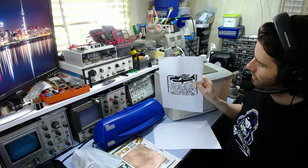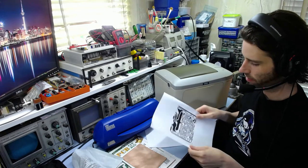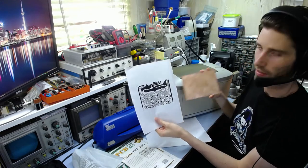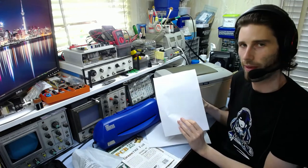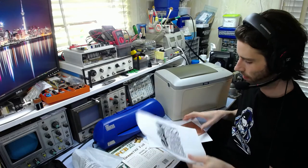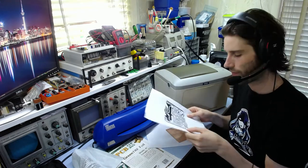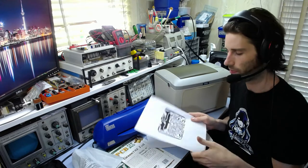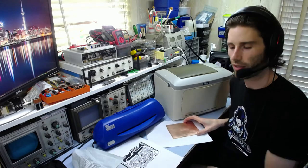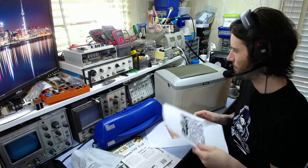Here's the artwork. An important point: this is printed backwards. It's the correct way up as you'd view it from the copper side of the board, but when you stick it onto the board face-down for etch resist, you have to flip it, which means it will be backwards. So you need to print the image mirrored so that when you flip it over it becomes the right way around. The most obvious indicator is the text — it should read correctly when the paper is face-down on the board. Do a test print on normal paper first to be sure, so you don't waste the expensive paper.